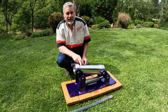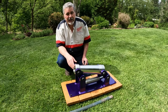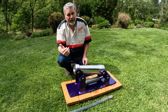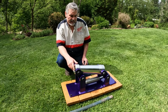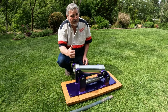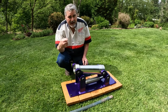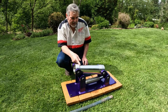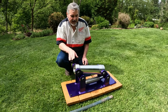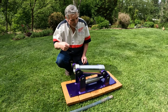The lathe that I spun this on at our shop was not big enough to handle this heavy of weight or the length and what I was trying to do with it. I had to build all kinds of different extensions for my drills and boring bars. I had to hang the tail rest way off the end of the lathe and build adapters for that. Chattering was a big problem as you're drilling or boring. If it did chatter, you tried to clean up the chatter, you can only take little tiny cuts. The main barrel, the taper on the barrel, everything's done by hand crank. You might be able to go like three inches cranking on the taper, then you'd have to reset everything, back it up, cut another three inches, another three inches. I took — I can't even tell you how many cuts — a lot of cuts, cranking and cranking and cranking by hand.